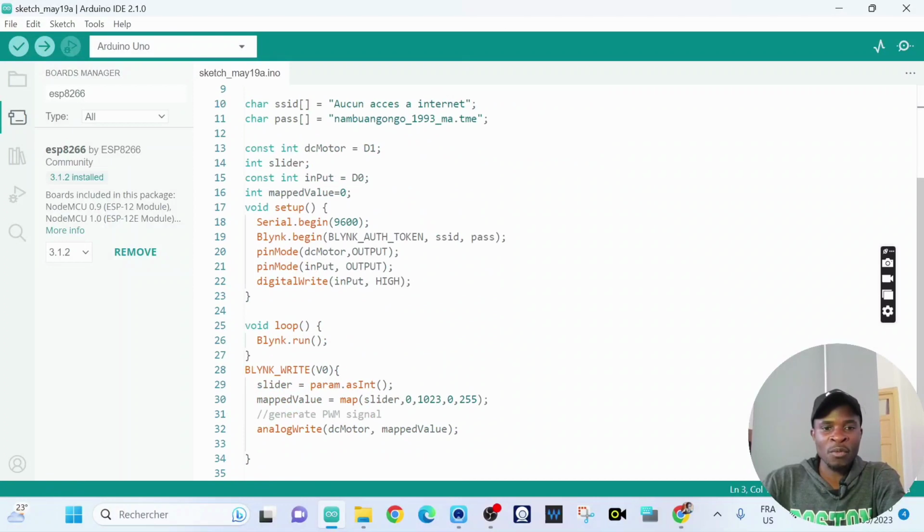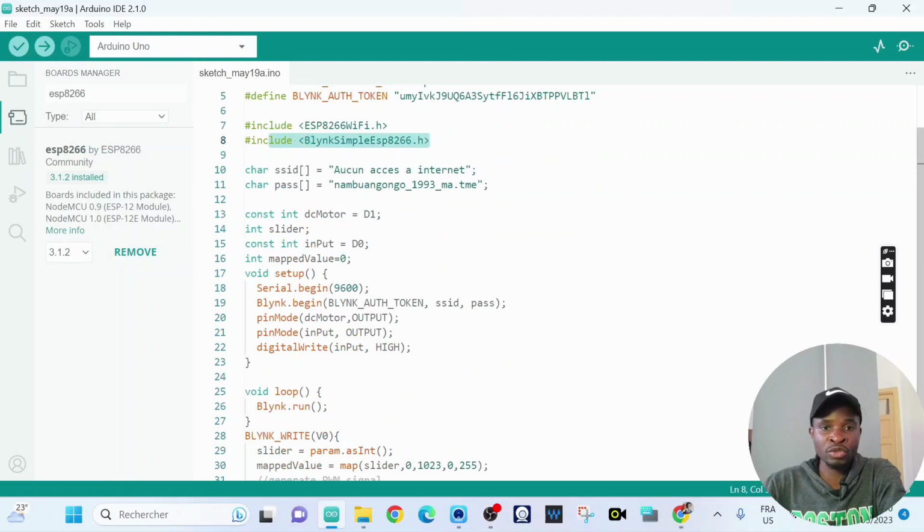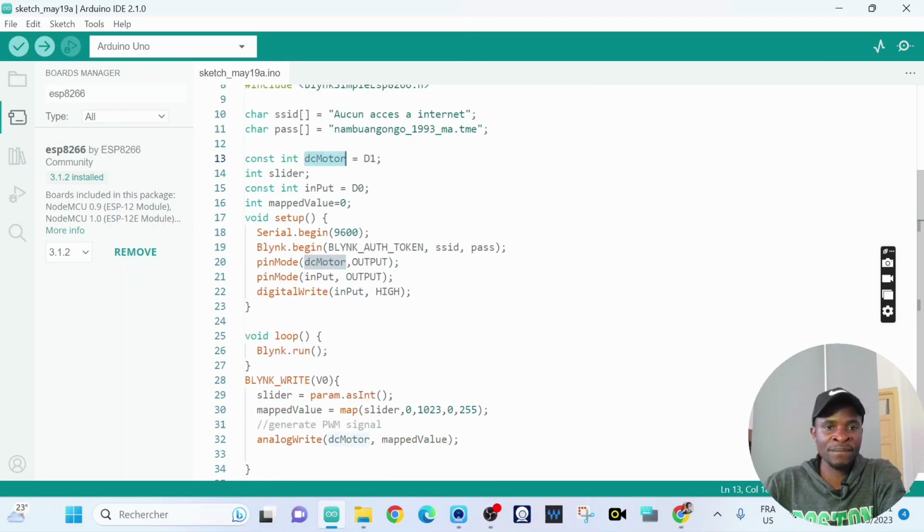Okay, this is our program that I'm going to provide in the description of this video. So you need to install this library and the Blynk library also, and you're going to provide the name of your Wi-Fi and the password. That's this motor, the fan connected to pin D1, the variable slider, and the input 1. Okay, input 1 is the pin D0, and the mapped value.